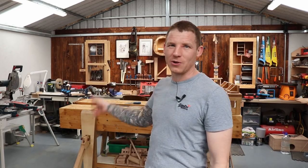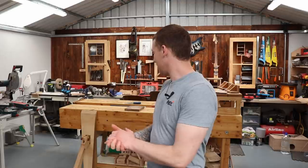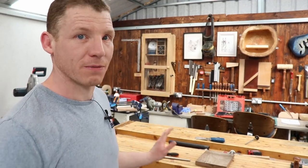I've changed the mechanism again on this — made it even easier to use, simpler range of motion, and everything can be operated from the front just using the cam lock itself. If we need more clamping force we can add a bar to the back. I'm not going to do any building in this one because it's the same processes used in parts one and two. We'll just look at the mechanism, discuss the pros and cons, and I think this is probably the best iteration of this leg vise so far.